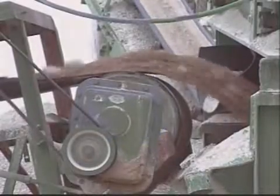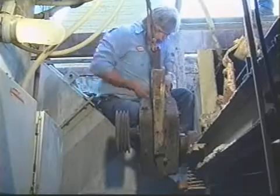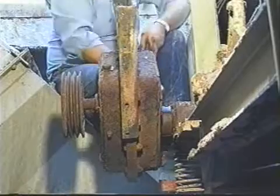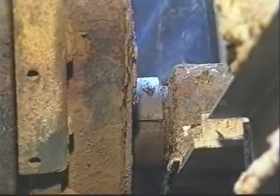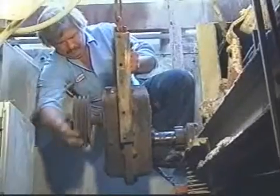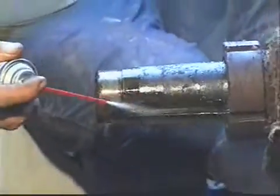But the real superiority of Falk's field-proven TA taper bushing is best demonstrated by how it simplifies Quadrive removal, even after years of tough-duty service. In most cases, simply backing off the bushing nut is all that is required to provide the necessary separating force on the bushing flange to force the taper bushing out of the hollow shaft taper bore. The drive can then be easily slid off the taper bushing and removed. And removing the taper bushing from the shaft for reinstallation later is simple and easy.